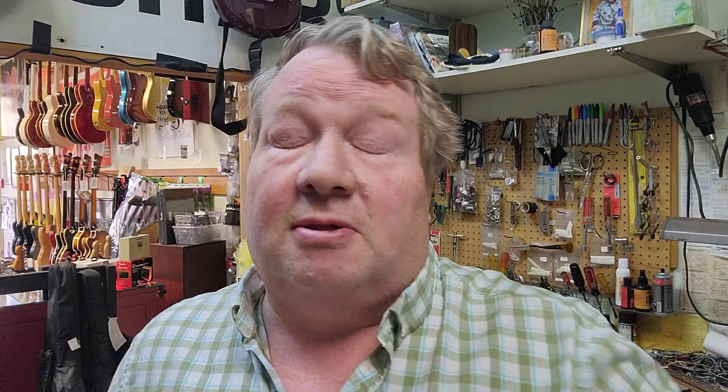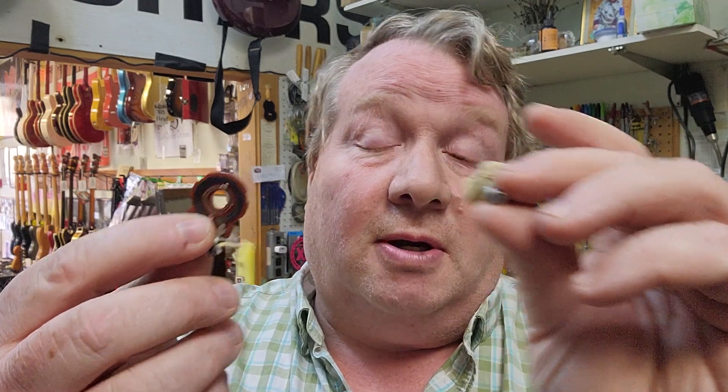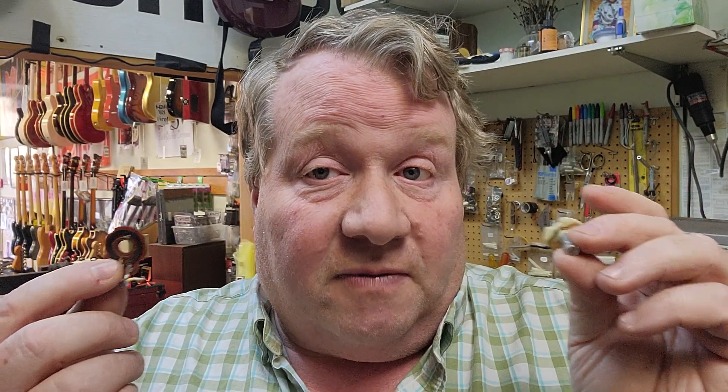They're crucial in guitars and vintage amps especially. What happens when they malfunction? Dissimilar metals corrode — one of the few things I remember from science classes. Just like on your car battery, you have two different kinds of metals attaching, and that's why all that corrosion likes to bubble up. These are likely to corrode where they touch. Often they get moved enough that they're kind of self-cleaning — when you move the pot, you can break that corrosion and turn it into dust.